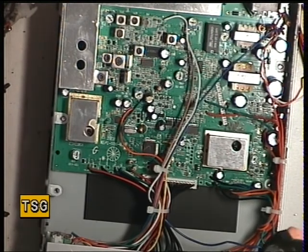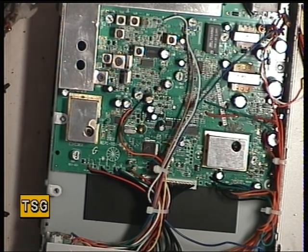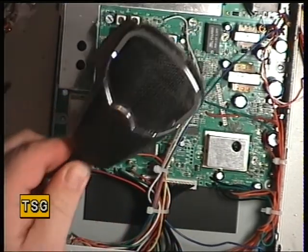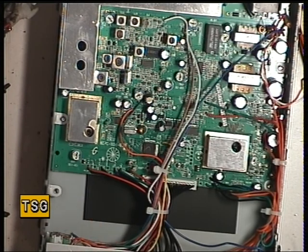Deviation — I've adjusted this earlier, because we did do some tests without doing a major tune-up, with the oscillator on. That's now what it should be. I'll just do a quick whistle test — yes, that's spot on. Have you ever seen a microphone like that? I presume it looks like a cobra with its mouth open. If we needed to adjust the deviation, as we have done earlier, it's RV1, which is the deviation control, and that's set for between 2.2 and 2.5 kilohertz using a deviation meter.